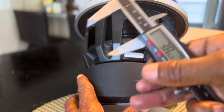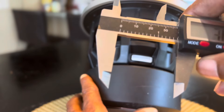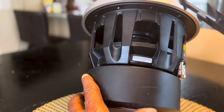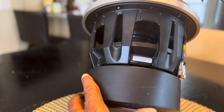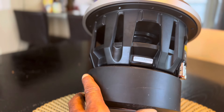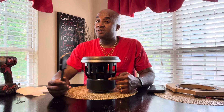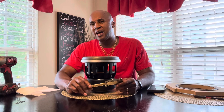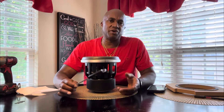We're gaining more X-mechanical — well, not gaining more X-mechanical exactly. What I was told by the manufacturer is that the reason this is done is so that you don't have the cone limiting your full excursion on your surround by having it connected at the triple joint. I've showed you the distance from the spider landing to the top plate is 38 millimeters, the listed X-Max is 19 millimeters — totally believable. I wonder what the X-mechanical is, but we've got plenty of room for throw.